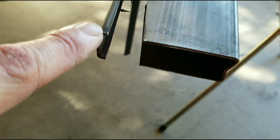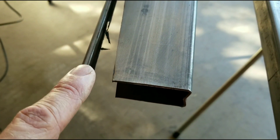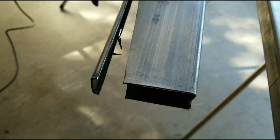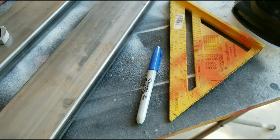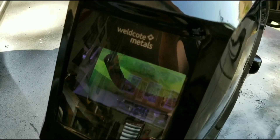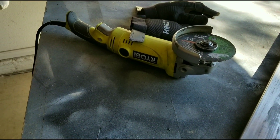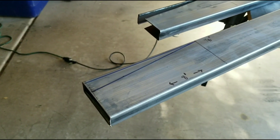The idea here is that on the top of this metal there's a nice little rounded chamfer. On my previous ones I just cut the top off and ended up having to come back and fill it in, which is really hard to do. So this time I'm going down only an eighth of an inch to preserve that chamfer. That way when I grind this weld off I should be able to keep that corner looking like a factory piece — that's the whole idea, to create the illusion it was made in a factory. There's nothing complicated here: a Sharpie, a straight edge, a welding helmet — this one's about 70 bucks at the welding shop and it's really good — and a four-and-a-half-inch cut-off wheel with a flapper disc to clean up your work.